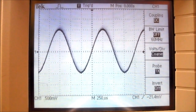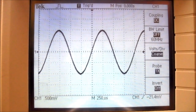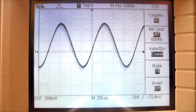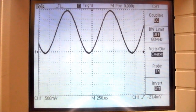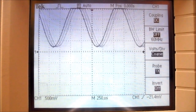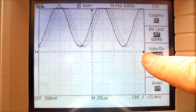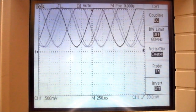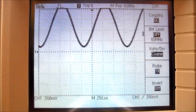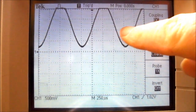And try to adjust your knob so it's kind of centered. Now rotating the knob clockwise should add DC offset to my waveform. And if you add too much DC offset, it will go above your trigger line. So you need to adjust your trigger level knob until the trigger arrow is in part of your waveform.